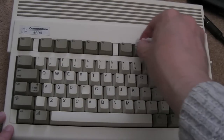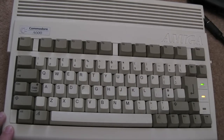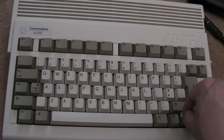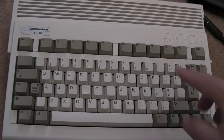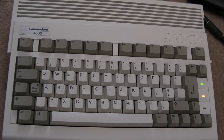But I jumped around a little bit because as I checked things, things started to look okay in terms of the reset. But ultimately, yeah, it was the reset. It's another example of Occam's razor. I'm sure you're sick of hearing me say that. But you know what? Had he just sat down and thought about Occam's razor, the simplest explanation being the most likely. Well, what was the issue with this? Well, it needed recap. We had some capacitors here and some capacitors over here. Well, the reset is where the capacitors here are. So it kind of stands to reason when you tie in the behaviour with the red screen.